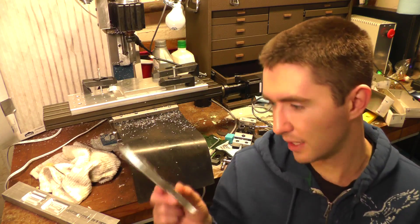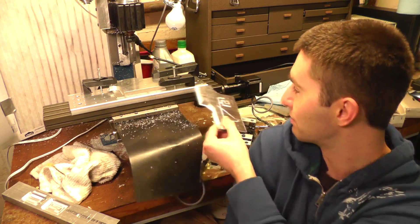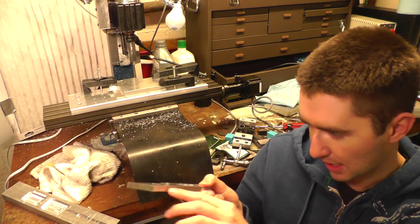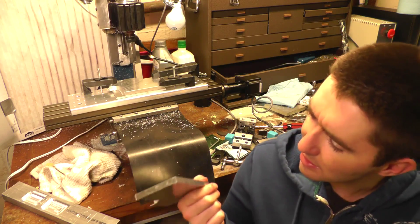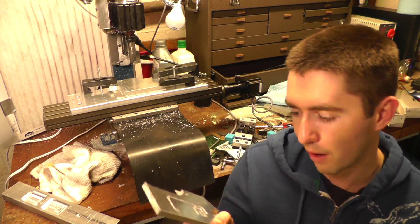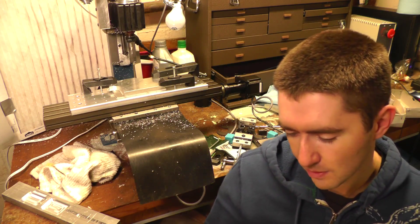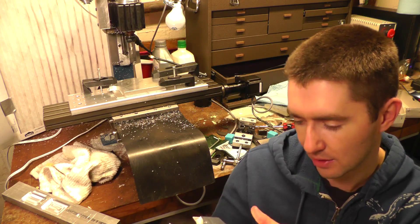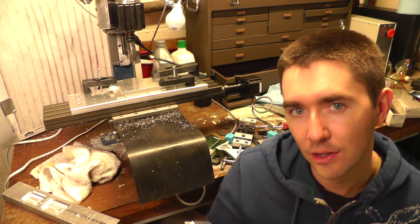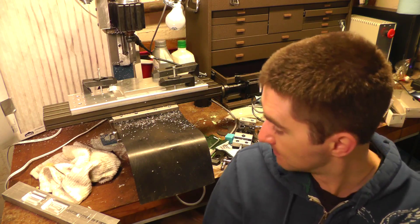I want to do that. I tried it on this one, I had some clamping issues, and what I've done since is put this tooling plate back on. The idea is to cut all the way down through a piece of material, through the stock. This one's about three-eighths of an inch deep. I'm going to trace out the profile enough times so it actually cuts the thing out of there. I haven't done this yet. The challenge is the work holding, and once you're through it, it's going to start vibrating and wanting to pop out. So let's get to the work holding.